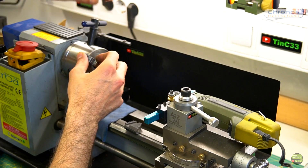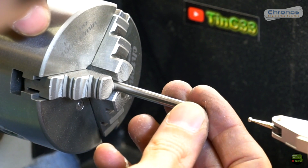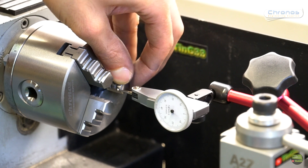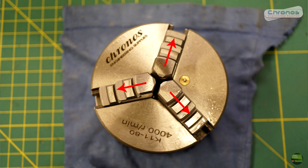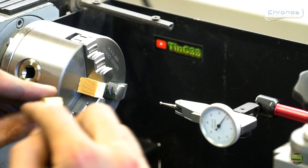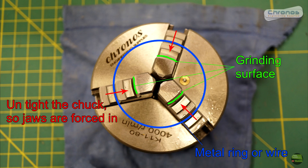So it's all acceptable for the 3-jaw chuck. But it bothered me that when clamping a piece it holds only at the beginning of the jaws, not at the end — so I always got clearance between the end of the jaws and the workpiece. So I decided to grind the jaws. I'm doing that for the first time, completely amateur, so don't trust me on this. We always have some clearance between the jaws and the snail gear — in my case about 20 thousandths. So theoretically we need to push the jaws into the position we want to grind. If we want to grind the inside of the jaws, we need to tighten the chuck before grinding. For grinding the outer side, there are special springs installed between the jaws to push them out to position. I didn't want to make them so I just use a piece of wood as a shortcut. For grinding the other side of the jaws, we loosen the chuck under load — I used a piece of wire since I didn't have a ring of the right dimension.